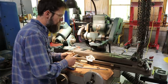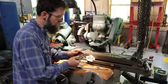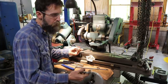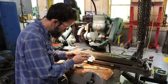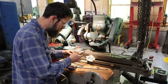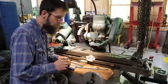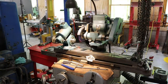So I just used the cutter grinder for the first time in probably a year. Had to knock down a quarter inch dowel pin to 6 mil. 250 thousandths is a quarter inch, obviously, and then 6 mil is 236 thousandths, so you knock off 14 thou. And there you go, just a locating pin, and I hit it within probably 3/10. Close enough, right? Just for location. Better than no pin. Let's go cut this and install it.